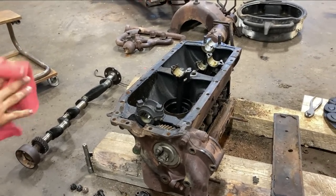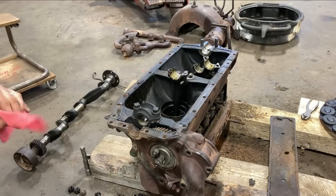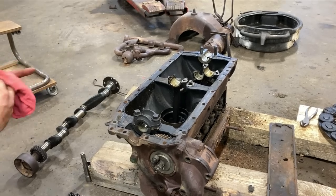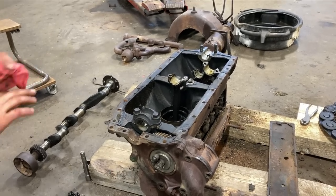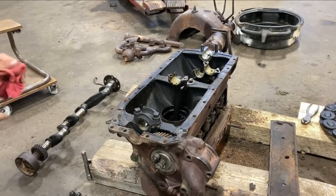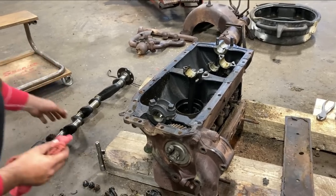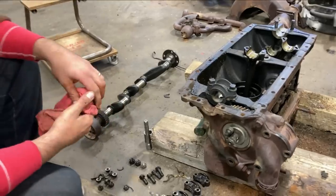As it wears, it allows you to take out shims and keep your clearances within reason. They're quite tight because there's no oil pressure. For those familiar with engines, it's one and a half thousandths clearance on the bearings — the rule of thumb is a thou per inch of shaft size, and these are just about one and a quarter inches, plus or minus.